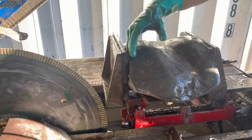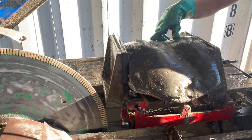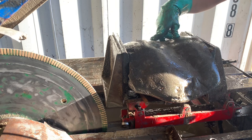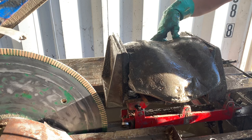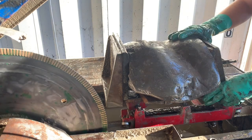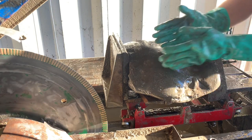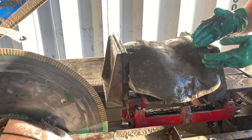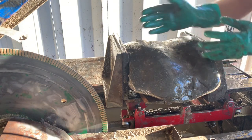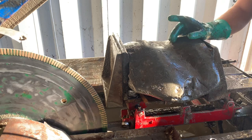So to make one sharpening stone, you need quite a few cuts. You gotta take two end cuts on your initial boulder. On this one, we took a third one just to make it fit in the saw. So that was most of yesterday for cutting. That was about 5 hours of cutting or so. And you know, then you throw in a little bit of time too to get your stone clamped properly. And then for a slab, it's two more cuts, and then probably four more cuts at that point to trim out the final shape. So quite a bit of cutting goes into just making one stone.